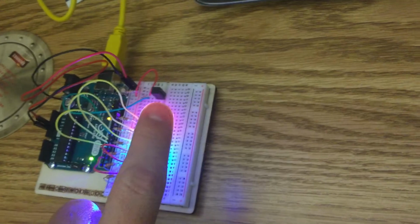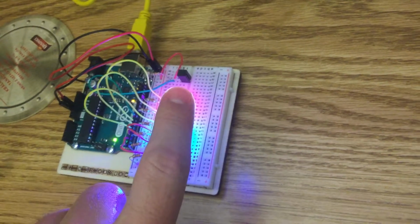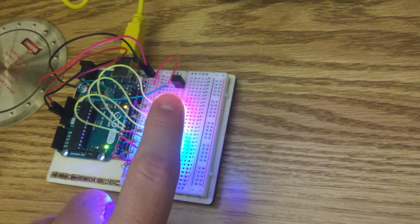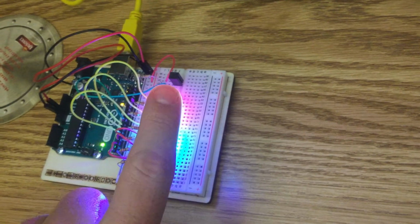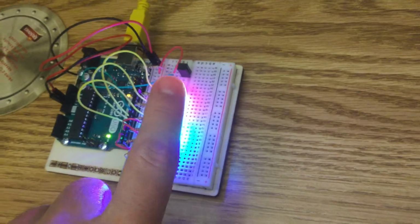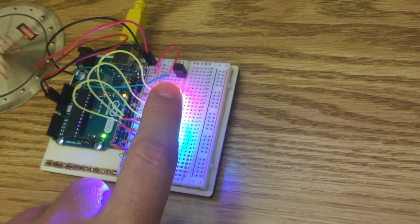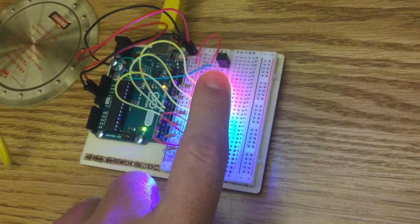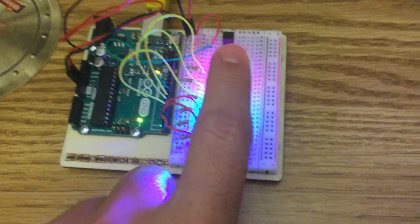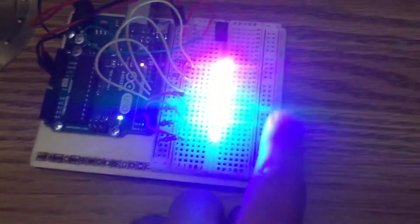That's what you see right here, because the switch is very soft and finicky. The switch right there is very finicky because even the smallest amount will move a little ball on the inside. That ball basically moves up and down, and if it's down, it's connecting the circuit, kind of like closing a switch, which sends a signal, because power is actually flowing through it, into that green wire. Now over here we have 6 LEDs going in through pin 2 to 7, and all that is once running through the loop, it turns on the LED.